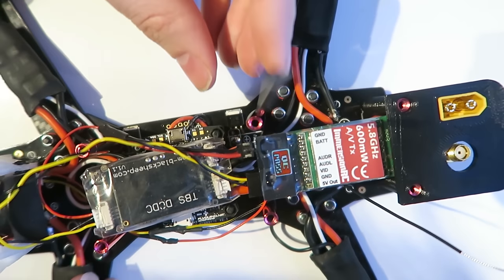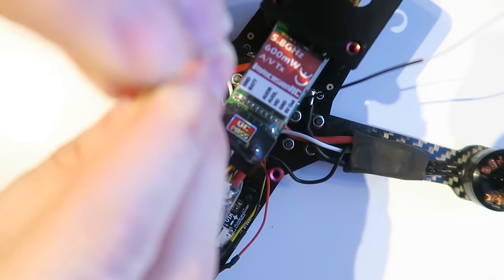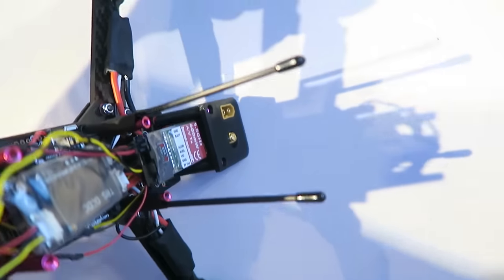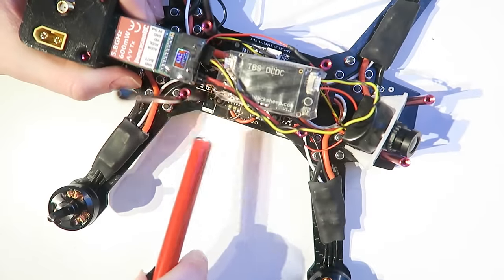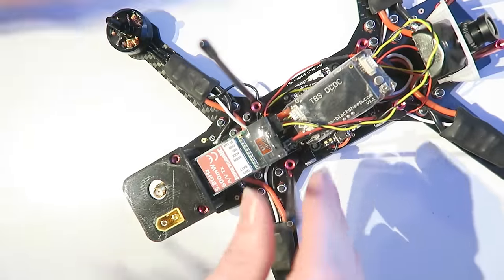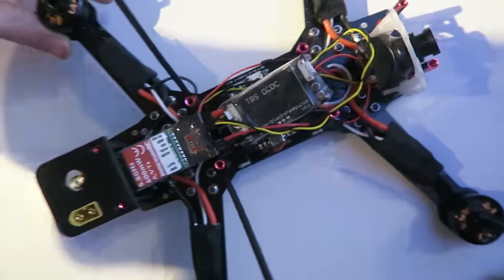And that's going to sit on one of the standoffs. And then we have the tip there that just tension fits over the top. Just makes a nice, neat job. So that looks like this. But then what we can do is using that candle lighter, I can heat up the heat shrink, which tightens it all up, but it also melts those straws to the point where you can actually bend them to about 90 degrees, because we want them to sit at 90 degrees. Don't heat them up too much, but when they cool down, they stay in place, and we have a nice, neat solution.